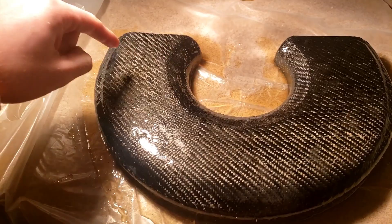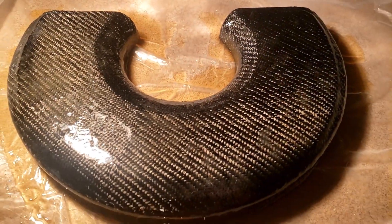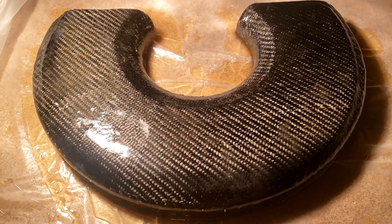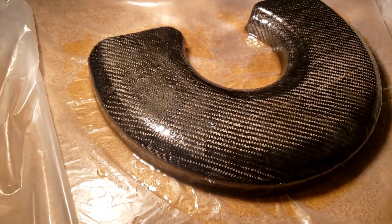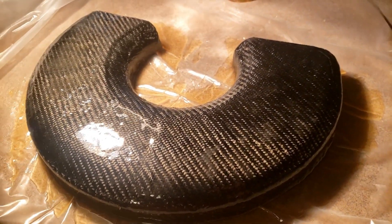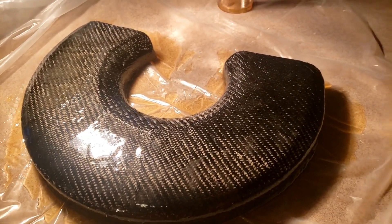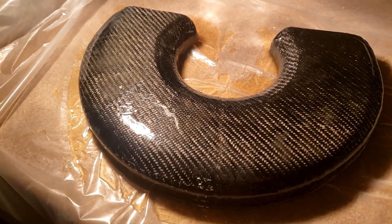The blushing is not going to be cosmetically pretty, but I think it's going to be discreet enough that you won't notice. The worst section is right where our tube is going to be cut in and grafted, so not too much of a concern. The rest of the texture you're seeing is just from using a brush to apply the second coat of epoxy — that'll all go away when we wet sand. Overall looks pretty decent. I learned what mistakes not to make on the next one, but none of these are catastrophic and visually we'll have a nice looking part.